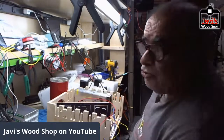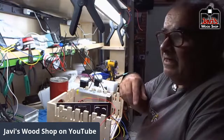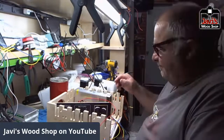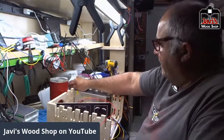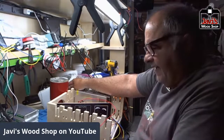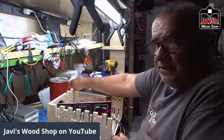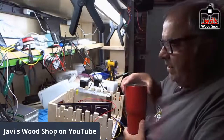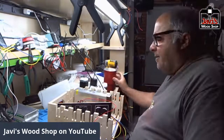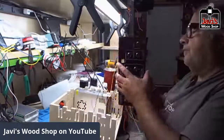A way around tramming is, like I said, if you're surfacing something, do a 5% pass instead of a 90% pass. That way, you're not going to see any ridges, or they're going to be so tiny you can sand them off. But anyway, that's if you want to bypass the thing. If you want to go through the trouble of actually tramming it, Peter Posuelo has a good video out there. Mark Lindsay has one out there. Yeah, I don't know. There might be some others out there.